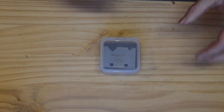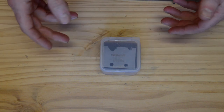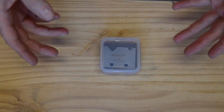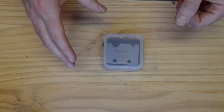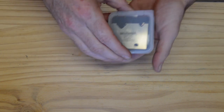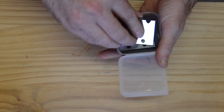Let's take a look at these knives. The different knife series that Whitehill have carry a different letter designation. These profiles are ground on their B series knives, which is the largest collection. They will fit in the ubiquitous 40 millimeter euro block, but also in their 125 by 55 limiter head as well as the large combi head, which I've talked about on the channel a number of times.